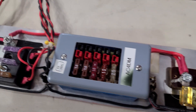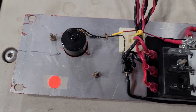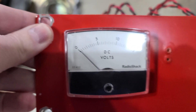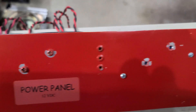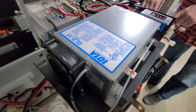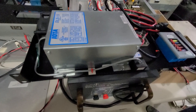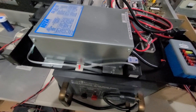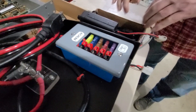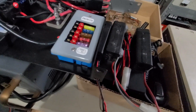We're going to need a power panel where all of our power comes in — a distribution box, fuses, and so forth — and a power meter so that we can make sure we're getting 12 volts to the radios. Having plenty of distribution for auxiliary power for various radios and other accessories is really handy. This particular power panel that he had created will be perfect — we're just going to repurpose it. For the power supply, IOTA makes some really good power supplies and battery chargers, and that's what we're going to use: an IOTA DLS-15 inside the cabinet, along with a distribution box giving us additional connection points for the radios.